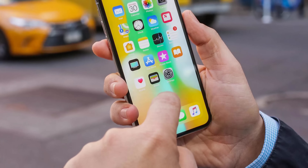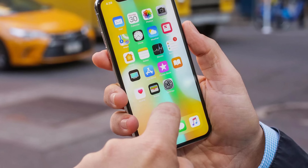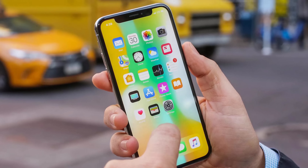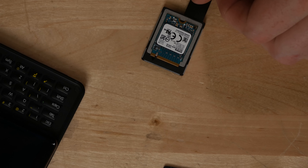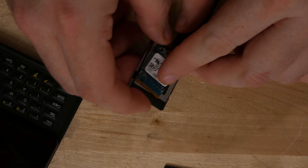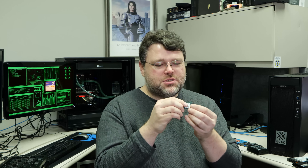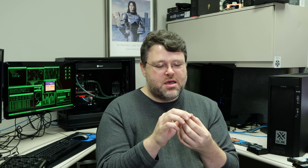Also on small devices like phones, look at this package. Even if you're an obsessive compulsive designer at Apple who doesn't want the design to take a backseat to anything, you have no excuse about taking away upgradability. Because the tiny M.2 form factor here means that literally anything — this would even work in an iPhone 12. And there's no compromises. This is a PCI Express interface — you don't have to worry about some weird proprietary interface or carriers. You could even solder this directly onto something, just the one BGA package.